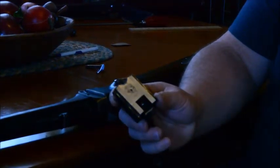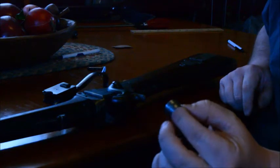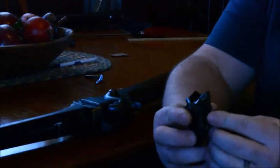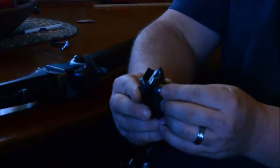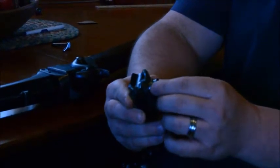This gas check plate no longer comes off — it's part of the block. Then he takes and puts a sleeve in here. It's a two-piece sleeve: one part stays in there and this is the part that comes out. Right around here is where an O-ring goes. You put a rubber O-ring on that, then just cover that with grease. Stick this back in there, put it all together. That O-ring keeps a little bit of tension on the breech block, so now it makes a perfect seal and there's no gas leak. You can shoot this all day with this system.